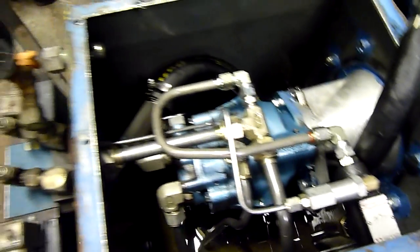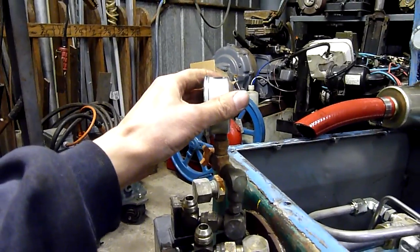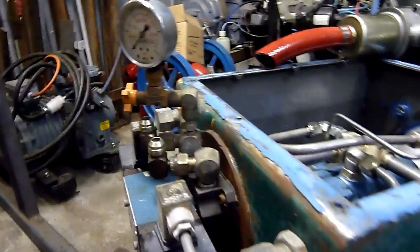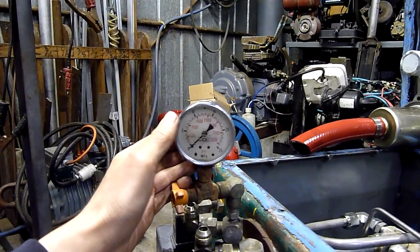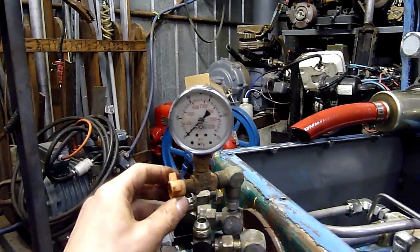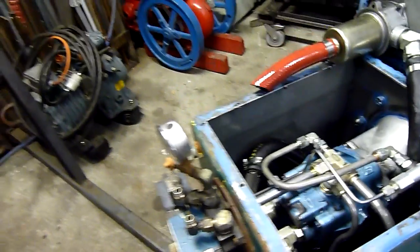They're probably one inch fittings — or three quarter to one inch. The lines look like three quarter, so I'd say three quarter. Outlets from here look like they've stepped down — going from three quarter to half inch — so I'm going to take these out. The pressure gauge can be relocated elsewhere. It's not even tight on that fitting anyway, it's just a leak waiting to happen. It's a good gauge though — the needle hasn't degraded. I find a lot of these the needles break or the glycerin becomes so moisture-laden that they corrode and the aluminum needle just breaks apart. I've thrown a few out because of that, but it's only active when you open the valve anyway. You can turn it off and just leave it, particularly if it blows out or starts leaking.